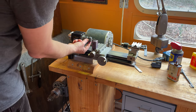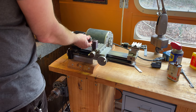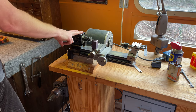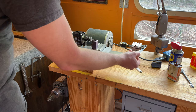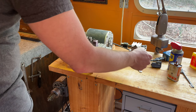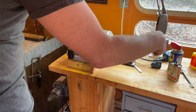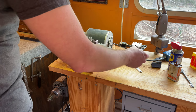I've got it set up with a collet chuck, which I really like, and this takes ER-16 collets. I think there might actually be a 5C head now — there didn't used to be. The tailstock is extremely basic. Some people modify these to be actuated by a tailstock wheel, but I haven't really found that to be necessary.